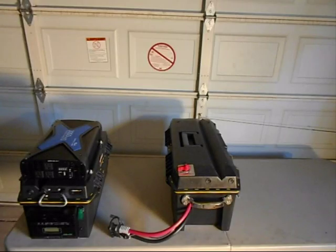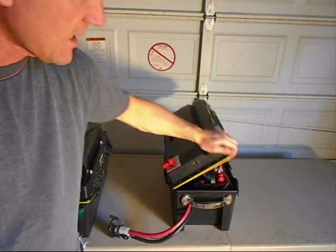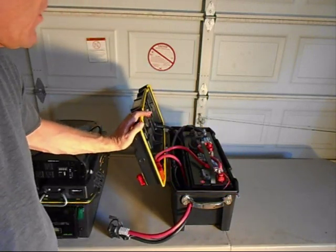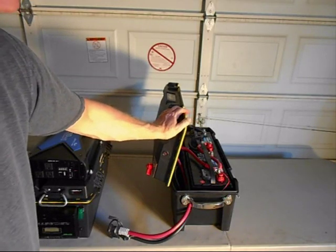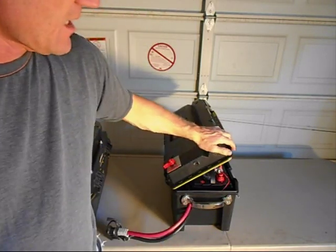Now, this is one example of the REACT system battery reserve power cable system. What we've done here is an option that anybody has the ability to do. We've taken the two batteries and the cable system. We purchased two batteries and put them inside a standard Stanley toolbox you get from Lowe's or Home Depot. They're wired in parallel, as you can see here, and we just drilled a couple of holes to run our cable system out of the end here.